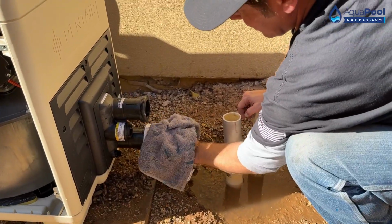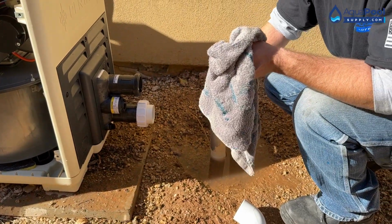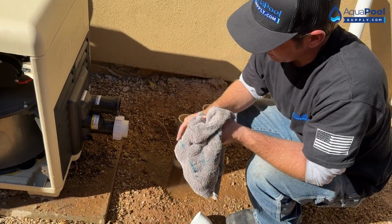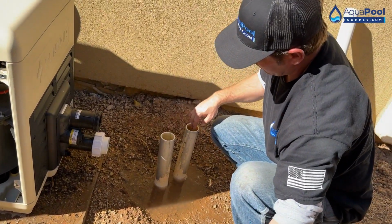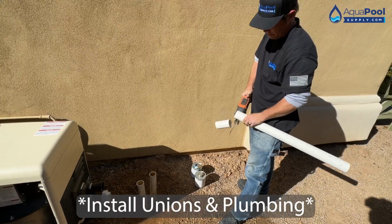With the upper pipe, generally we can line it up where it's going to be a direct shot into just the 90. So it leaves us with limited area if the top's already plumbed. So I'll always start with the bottom, which is the outlet. We identified this pipe as the inlet, so this will be our outlet pipe.